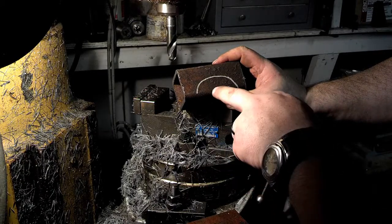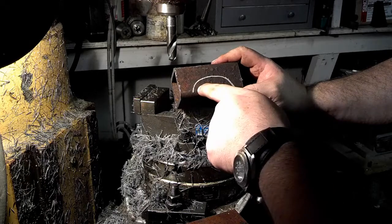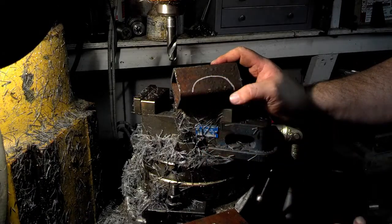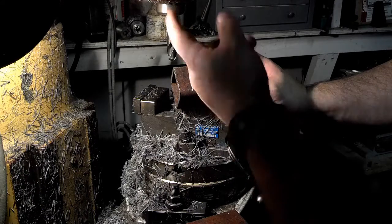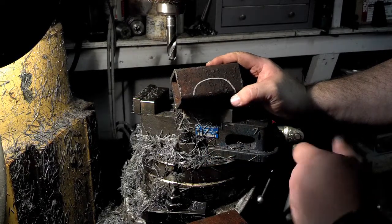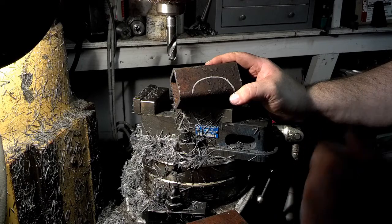So there's the hole saw. Now, another method would be to cut this out with a hole saw to get the bulk of it with an undersize, like say 2.5 inch, but then you have to actually cut all this out. And the two methods that I could think of off the top of my head are using a fly cutter that's approximately set to a 3-inch diameter, and the other one would be to use a boring head and use a boring bar to cut that. Now, the boring head and boring bar isn't the stiffest setup in the world. It's an interrupted cut. I'm not really keen on putting a precision boring head through this process just to hog out some metal. And I'd have to step it over a bunch of times, because if I went from 2.5 to 3, I'd have a 1/4 inch that I'd have to take out. Same thing with the fly cutter. You could nibble it down with a fly cutter or a boring head set at 3 inches, but that's another time sink. This method is actually pretty darn fast, and I'll show you.